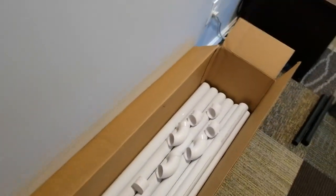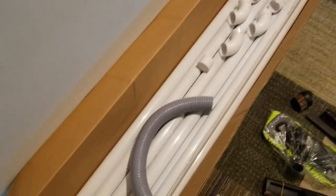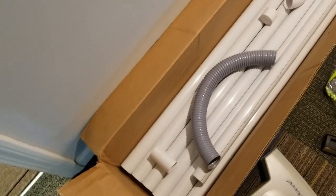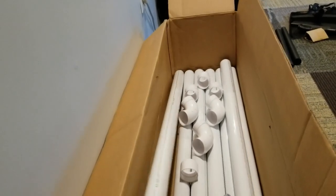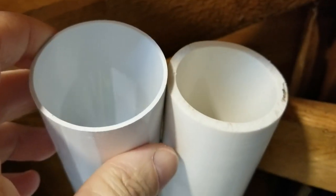This is what's left over after I bought a kit on Amazon — an install kit. It came with several different fittings: elbows, tees, sweep tees, unions, a can of cement, wire, and I believe 100 to 110 feet of vacuum tube. It looks like Schedule 40 but this is not Schedule 40. I believe they call it Schedule 20, although it doesn't say so on here. If you know anything about plumbing pipe, you can see it's a very thin-walled tube — not the same as Schedule 40. Here's a section of it next to a spare piece of Schedule 40 so you can see the difference.